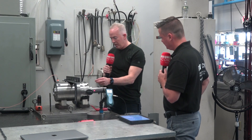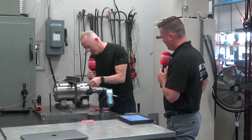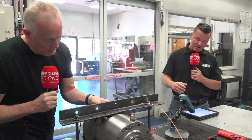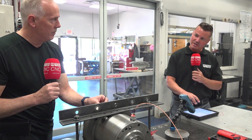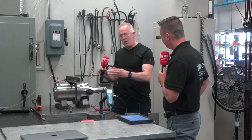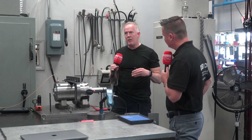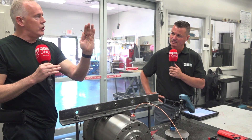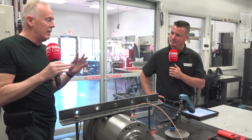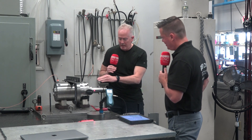I'm going to take this trial weight — which is just what the word implies — and thread it into this screw hole here. When I say trial weight, the software found what it thought was its heavy spot, but phase lag can fool us. So we put a trial weight in, take another reading so the software can say: I thought the heavy spot was here, but now it's shifted a little with the trial weight. It then makes the calculations and polar plotting to tell us exactly how much weight to add at exactly what degree to balance the spindle.